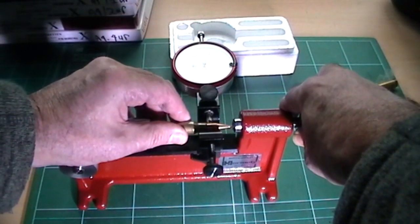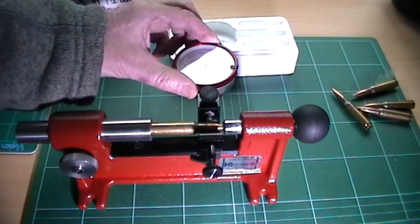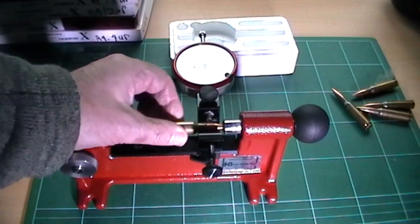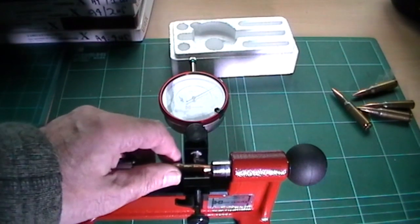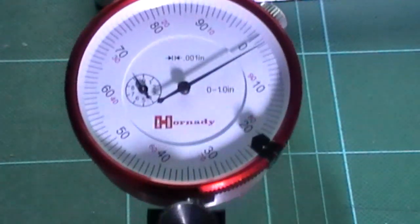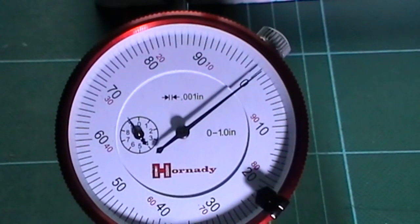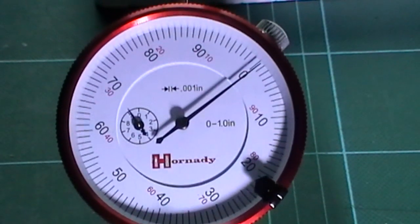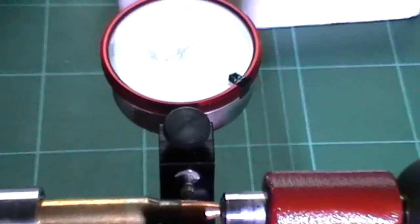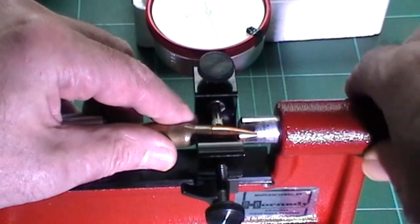So let's go ahead and put a round in. Pull this out and put the round in. Some people muck around to get the zero at the top, but it doesn't really matter where you put the zero. So you zero the gauge and you just rotate the round. I'll tilt the gauge so you can see — there's our zero reading: five thou, six thou. So you're rotating the round and the spindle is measuring. According to Hornady, anything over three thou does need adjusting. So we take that out and put it on one side.